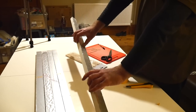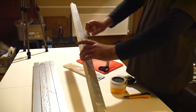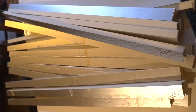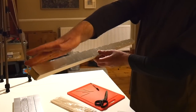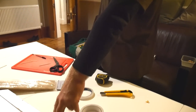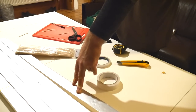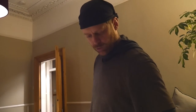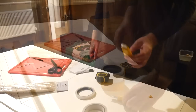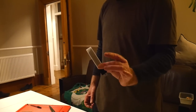These are just strips of insulation board that we've cut. We made up a jig for cutting them, but you can just do it with a straight edge and a ruler. These are 40 mil, which is fairly arbitrary but seems to work okay. This board cuts quite easily, although it does make horrible sounds. If you've got any sound sensitivity or are adverse to high-pitched screeching, you're not going to enjoy that process. Just cut them with a standard Stanley knife — it does dull the blades fairly quickly, so get a pack of replacement blades.